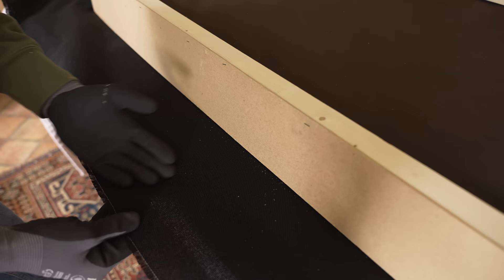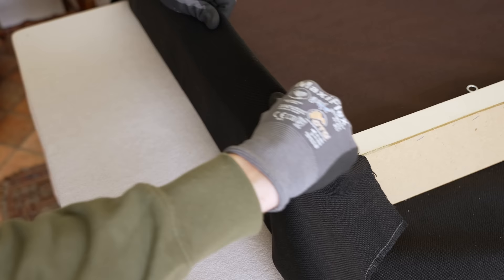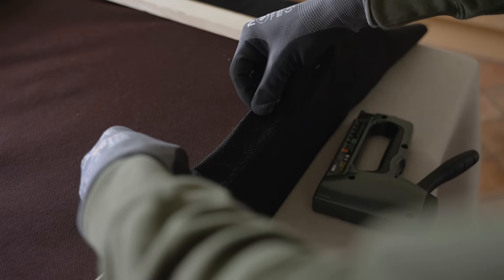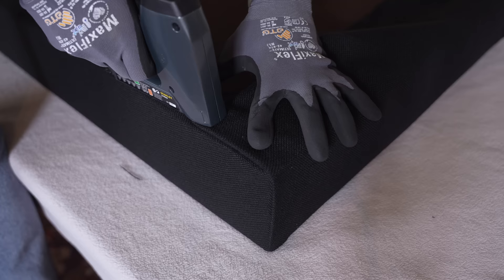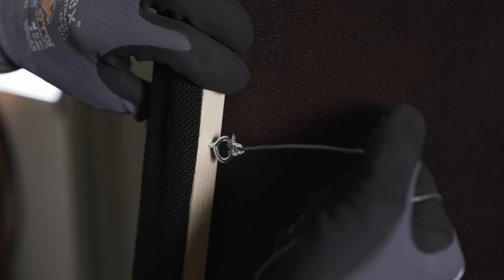Here I'm going to lay out the panel front side down with a generous overlap on each side. You'll see that when you cut the fabric you don't even need to cut it very neatly because we're going to fold it over and tuck it underneath to make a really nice neat line — it's going to look exactly like you know what you're doing. The method is to simply line up and staple one side, then put a small amount of tension, pull it over a little bit, and then staple the other side. The trick is to just take your time, line up a corner, fold it over, try again and again. If you're a little bit of a perfectionist this could take a while, but just take your time and it'll all work out fine.